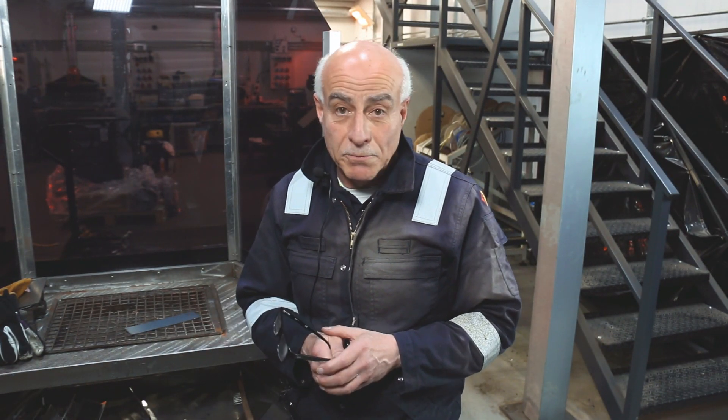If you'd like to join me in the workshop, we'll get welding. Just prior to looking at the spot and stitch welding, make sure and check that your welding torch is connected into the negative pole on the machine, and also your welding return is connected into the positive pole on your welding machine. Without further ado, let's have a look and see how it works.